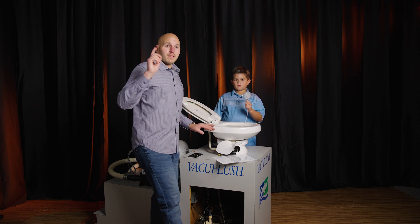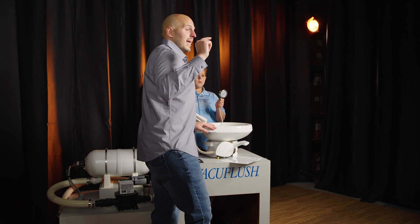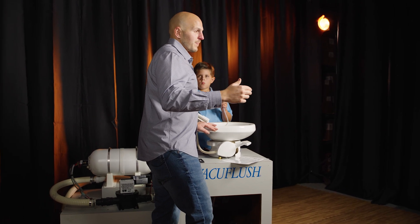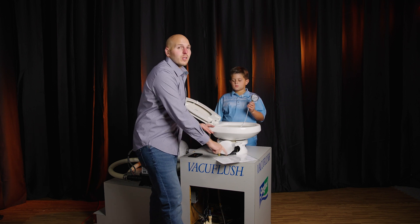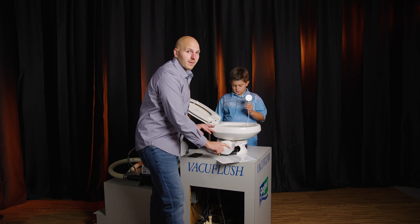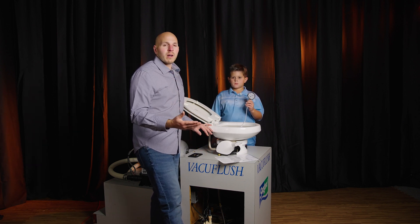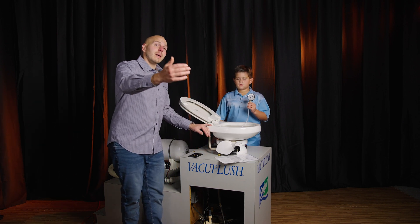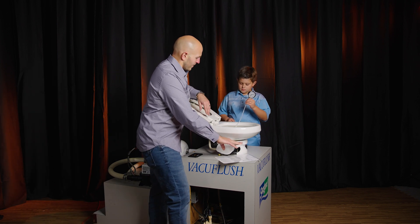But if your system continues to run every two to five minutes, or your vacuum gauge is dropping and you've looked at the chart on the vacuum tester gauge instructions and it's still running, I'd suggest taking a step further back. Dr. Nikki, we're going to pull that out of there — I'll step on the pedal.